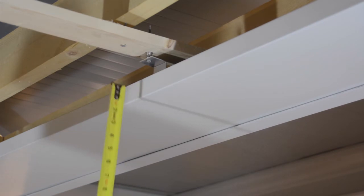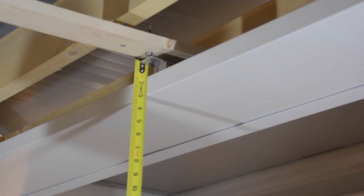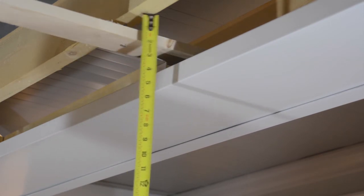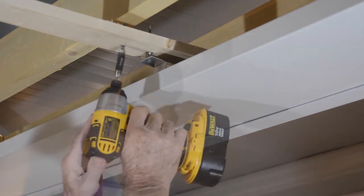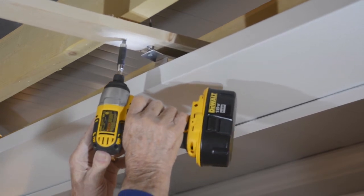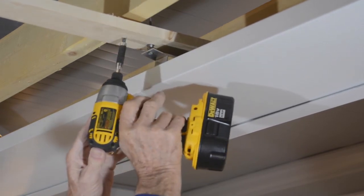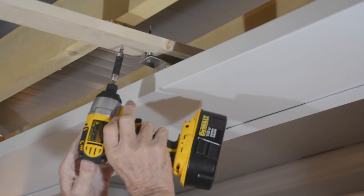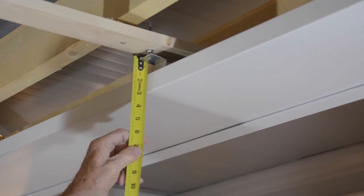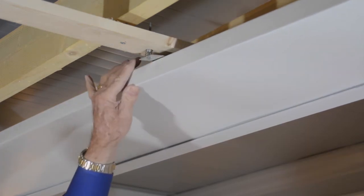After the panel latch is installed, the 1 1/2 inch clearance remains between the panel and the panel latch suspension board. A long panel may tend to sag slightly of its own weight. Sight along the length of the panel to see if this is the case. If so, adjust the height of the panel latch suspension board to true the panel without disturbing the 1 1/2 inch clearance you just established.